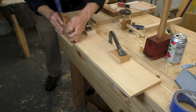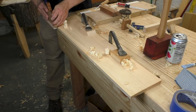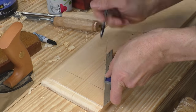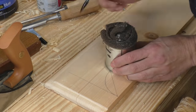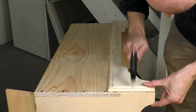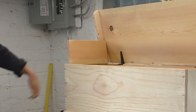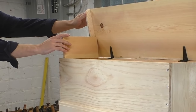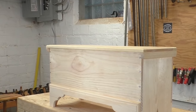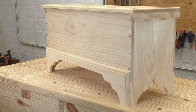And it's not difficult either. I've planed this piece of scrap wood down to make it a bit thinner, and now I'm cutting that same thumbnail profile along the edge and ends — it's going to be pointing up in the final piece, so it'll look different than the lid even though it's the same shape. A little layout gives me a decorative bracket foot, and my oil can has a nice tight radius for those curves. I can cut out the entire detail all at once — there's no need for glue with this piece, just a couple of finishing nails. Once I have the big lid installed, I can test out my till and see how it holds everything open. I'm going to finish this with milk paint and a little shellac for luster, and I think I'll ask my wife to pick the color. She can pick where it goes too — I just wanted to make it.